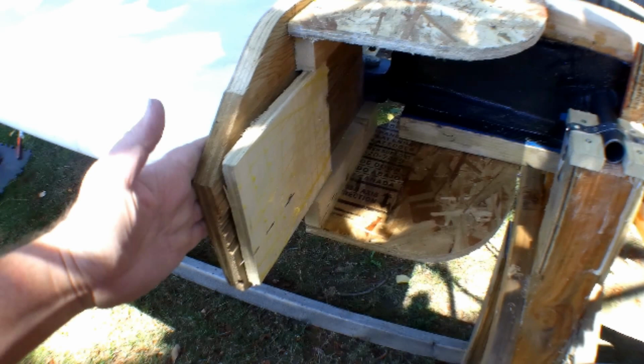This photo shows the leading edge attachment methods. The large plywood plate that my hand is on actually has a hole in it that engages a tube that comes out of the leading edge of the wing. This tube helps transfer torsional loads from the wing into the test stand. We're going to load up the wing on the spar, so there'll be very limited torsional loads. And then there's a lighter colored sheet of plywood on the inside, and that has a screw that runs through it into the wood dowel that's in the center of that leading edge tube. And that prevents the tube from disengaging from its mounting plate and prevents the wing from swinging fore and aft as we run through the tests.